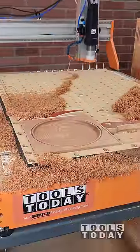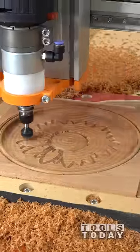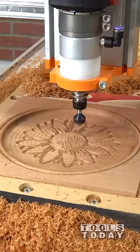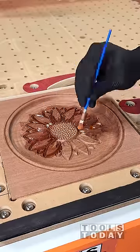Then we can go back and pick up the RC-45711 90-degree V-insert bit. This is a 90-degree bit, and I'm carving with the start depth set at what the finish depth is after the finish pass with the bull bit. So then we'll just go through — it'll carve super deep, and this is going to allow me to pour that epoxy in there and then flatten that off.